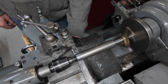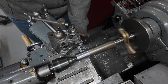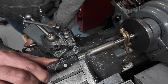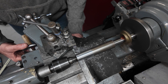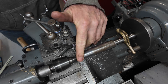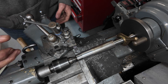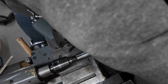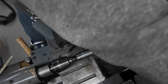We start out by turning down the ends of our mandrel. We'll need a thread at both ends and we need to relieve a section before the thread so that we can hold the mandrel in the chuck or the vice without damaging the threads. So we first turn down to the size we want our threads, then we turn down to the size of the relief. The relief needs to be small enough so the nut can get over the top of it to get onto the thread.